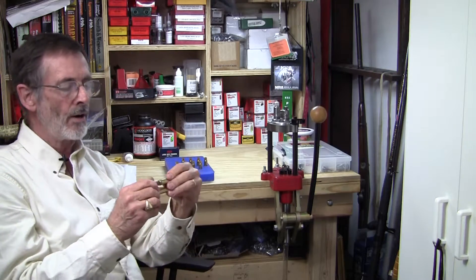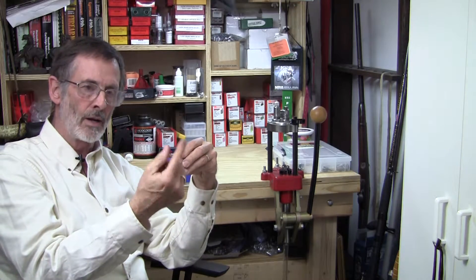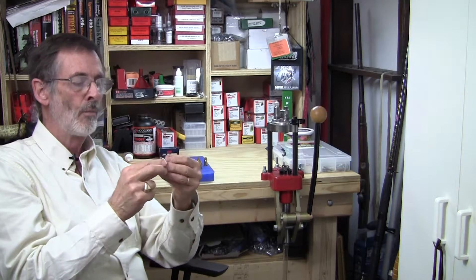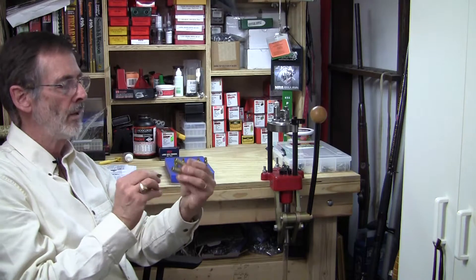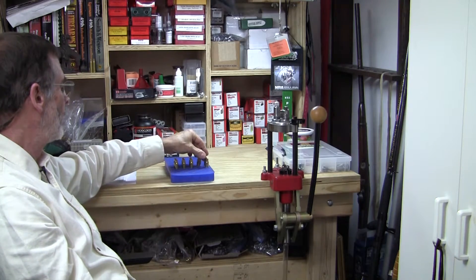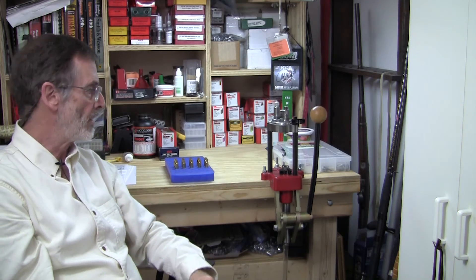You're not going to spend five minutes doing a hundred circulations of this tool by hand in a case. But with a motorized case prep station, if you hold it on too long, you can remove too much material, causing primers to seat too deeply and producing misfires. So I always just run this around to clear any excess crud in the primer pockets, physically check that the flash hole opening is free, and check the insides for lube and media deposits. And with that, these 10 cases are done and we're ready to move on to the next step: priming.